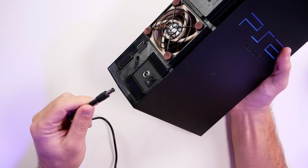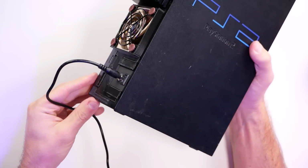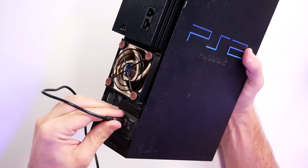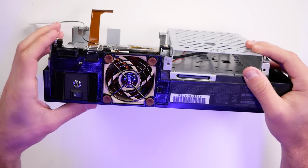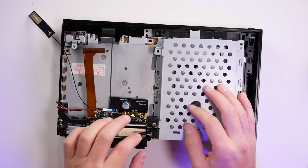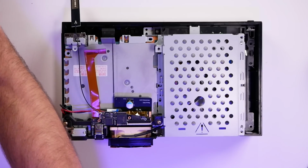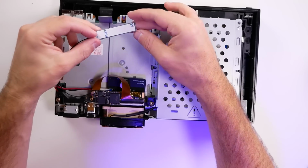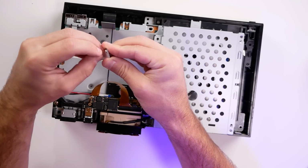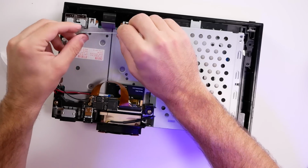It's not a big deal because the PS2 Slim technically goes that route as well, one of the ways that they were able to shrink it down so much, but I don't really like the fact that I went from what's a fairly universal cable now, right? The Infinity or the Figure 8 cable that we use for basically everything with the Xbox Series and the PS5, so it's pretty easy to switch them out, to what's basically a barrel plug from a laptop that's fairly specialized. In fact, I had to go online to get the adapter because it's a 12 volt, 5 amp. Not typical, especially with that barrel plug. Fortunately, it was on Amazon. It was easy to get, but it's not something you would have just laying around maybe at a friend's house if you took it over there.